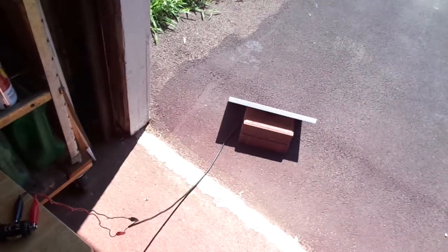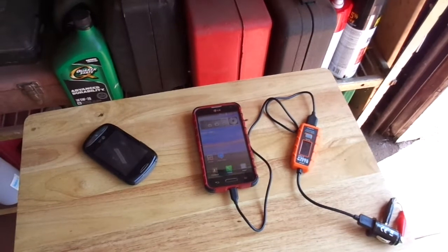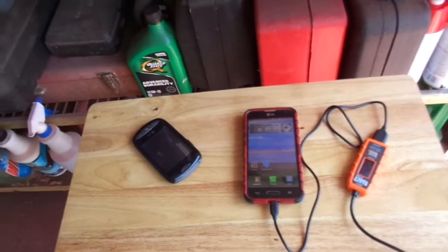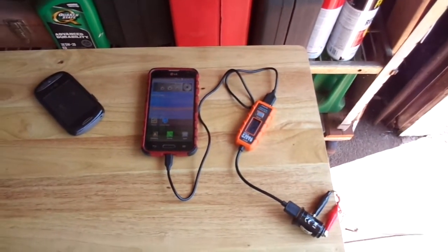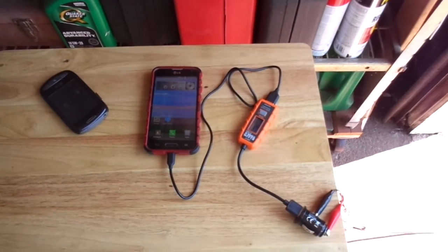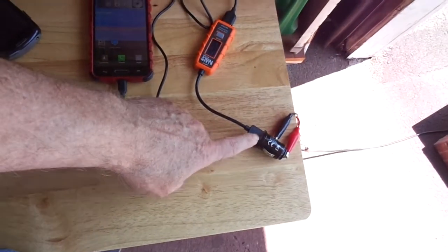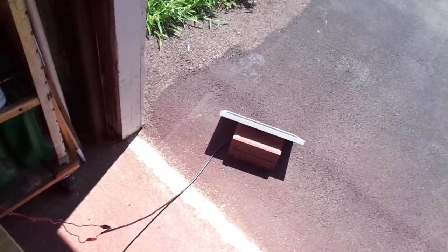Get yourself one of these little plugs that'll do 5 volts and approximately an amp. This kit is more than capable — it can produce almost two amps. Right now the phone is about two-thirds to three-quarters charged, so the phone itself is starting to limit the charge. When the phone is almost dead it takes one full amp, as you can see on this little measuring device. In full sun with a two-amp plug, this should just be enough to do it, but you won't have a lot of room to spare.